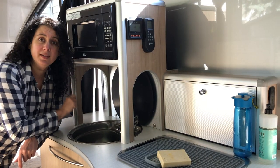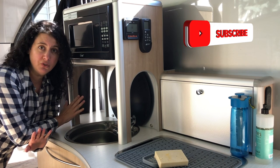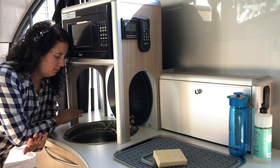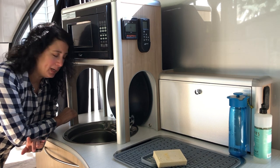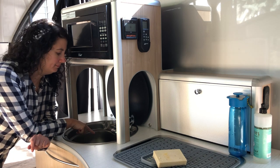I have opened the faucets and closed the faucets — they'll all remain closed now until I de-winterize. And the last thing I will do before I pack everything up and put it away is put about a cup of antifreeze down the kitchen drain. And that's it — we're winterized! Hey, we did it. I did not think we would be smiling when this was done because I wasn't really looking forward to winterizing, but it's satisfying to do. It works pretty easily. It really does.